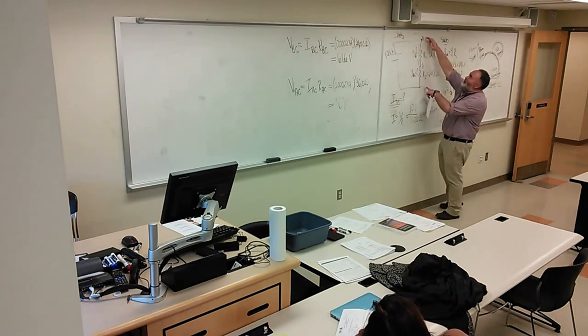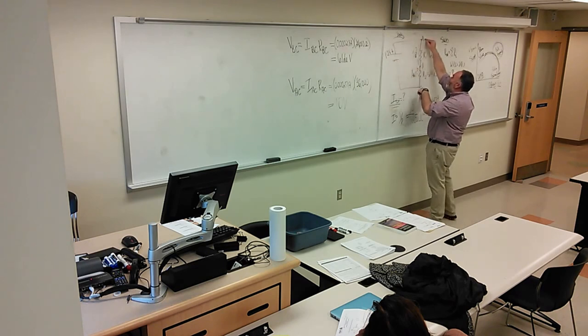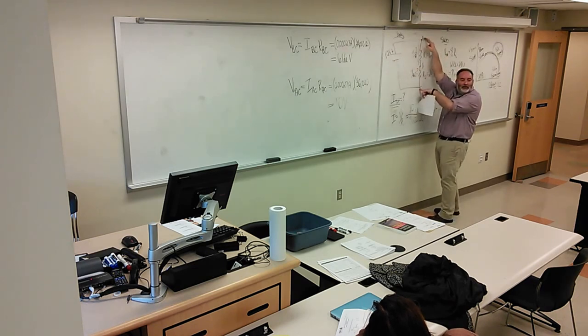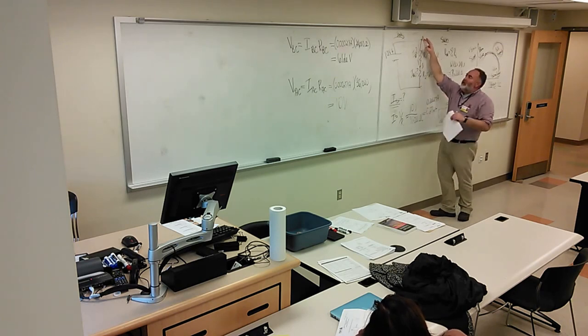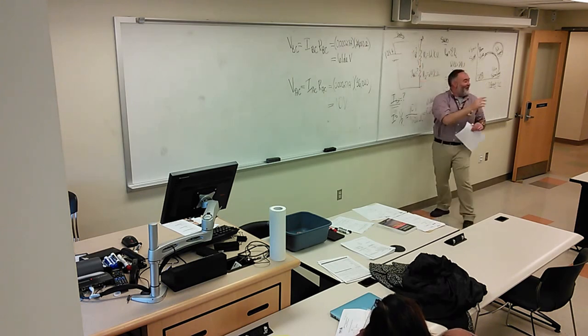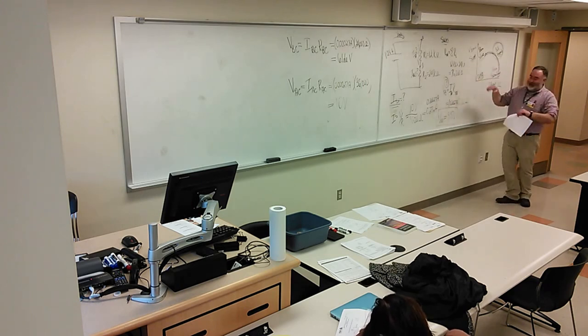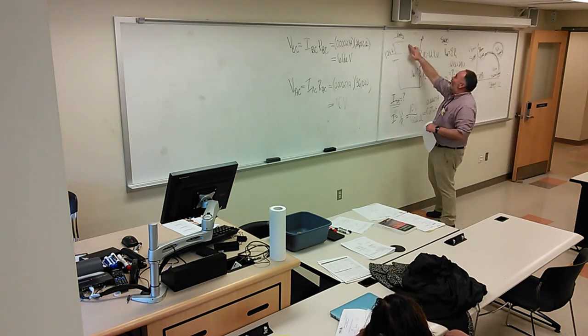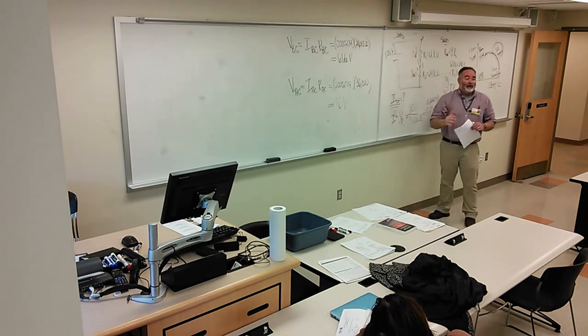What if I would have said, what is the voltage between A and C? Here's our circuit, 10 volts over here. There's A, there's C. Could you give me an answer without doing all the calculations? Yes. How could you do that? 10 volts. Where would you get 10? Because it's the same. This is just A. There's no resistor, it's just this point. It's 10 volts. We already knew that.